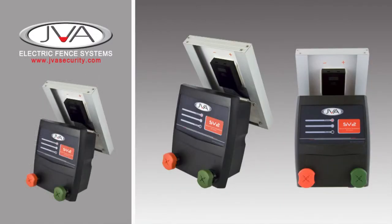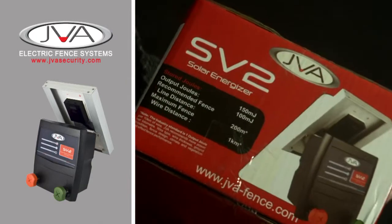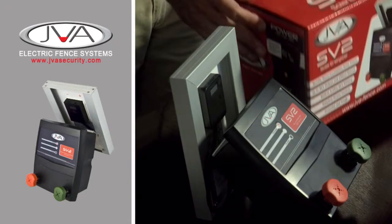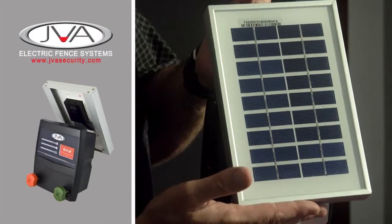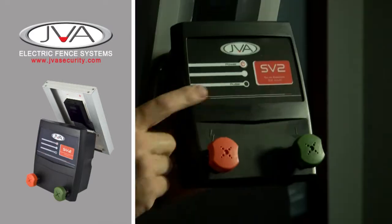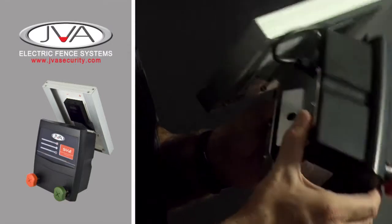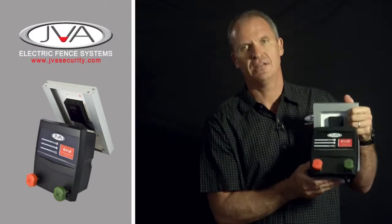The SV2 is a great little portable unit. It's solar operated, has an internal battery, so it's ready to go straight out of the box. Not a very powerful unit — just 0.1 of a joule — but this is perfect for short distance fences, portable fencing, strip grazing and pet fencing. The SV2 has a large solar panel, which means it's got a good charging circuit. It will work 24x7, 365 days. The unit has a power switch; a pulse light that pulses red when everything is good; strong, robust terminals — your earth terminal and your positive terminal. Plus on the back, a nice picket mounting for your wire standard or picket. A lovely little unit, ready to go out of the box.